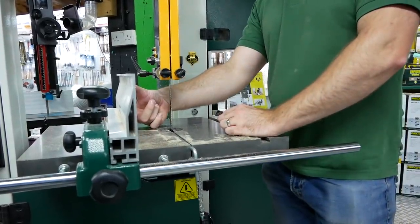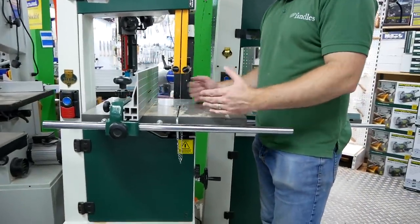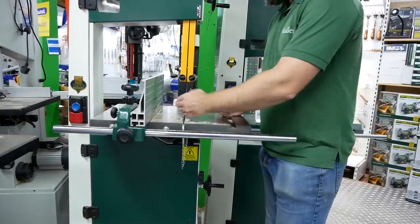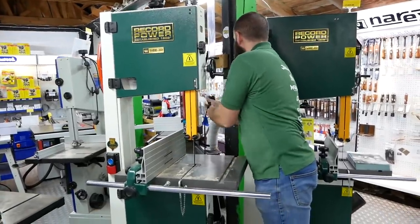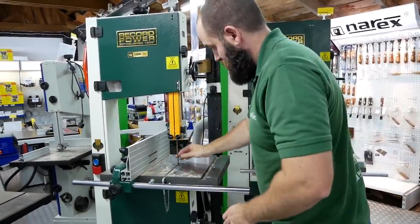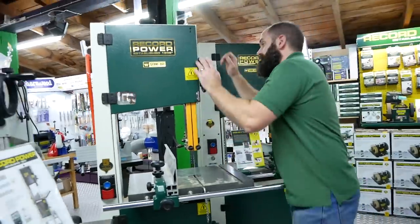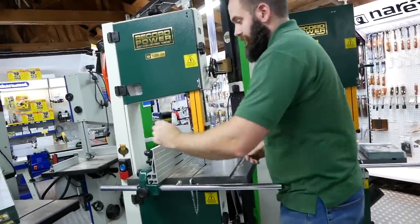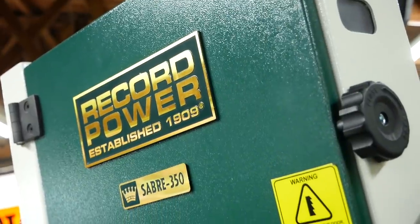It also comes with what's called a re-saw bar — just a bar of metal that you can put in there. The idea is that if you've got a live edge piece of wood, you can't push it against a straight edge because it's not a straight edge. But you want something to brace against, so you can use that bar and then cut into the blade. You can fire it up now — just make sure I've got everything tight. To tension the blade manually, that's up there like normal, and at the back you've got adjustment of the wheel front and backwards for the tracking.